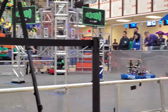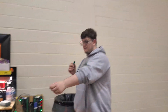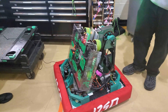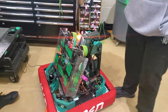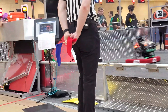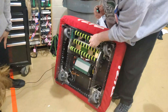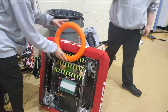You guys also have a pretty neat intake — it's an under-the-bumper intake. We originally started with a one-sided intake, but then evolved it into a double-sided intake. We do have to drive over the note, and there is a roller under here — it's the same roller that runs over if we use the front intake. This set of wheels is what we use for the back intake, and this is our front intake. It hits, goes in, then we continue to use the center alignment system we have already created.